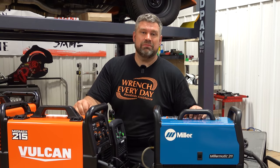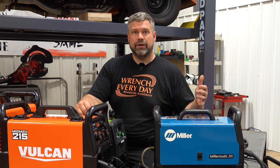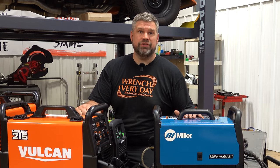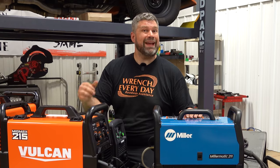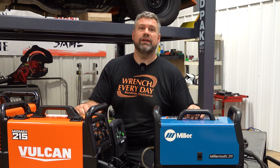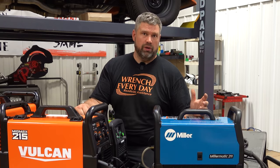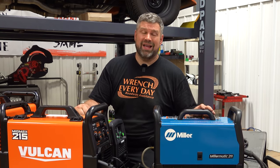Now, with those computers, you get some really cool new technology. Auto set, where you tell it the thickness of your welding, the wire you're using, and if it's shielded or not shielded with a welding gas, and the computer monitors and controls the wire speed and amperages for you. Now, not everyone likes that. Sometimes you want to know exactly what's coming out of the gun, so a more advanced user is not likely to use that, but if you're starting up and learning to weld, it can be a useful tool to have the machine looking out for you, helping you get the best weld possible, because welds are structural. It's not something you want to use an $80 machine for to build something you need to rely on being strong.